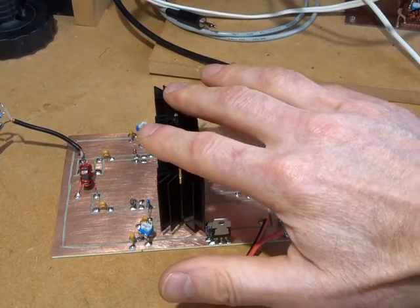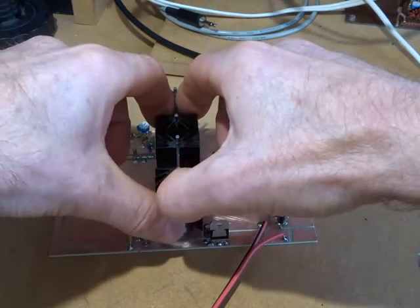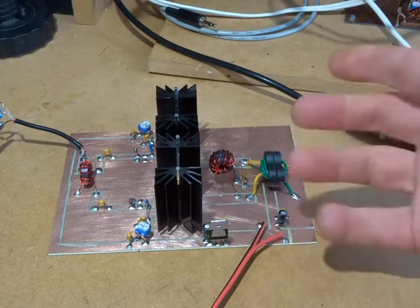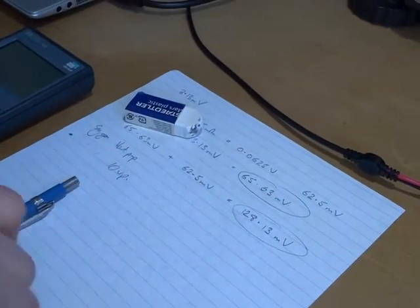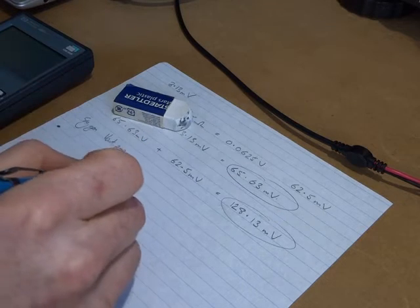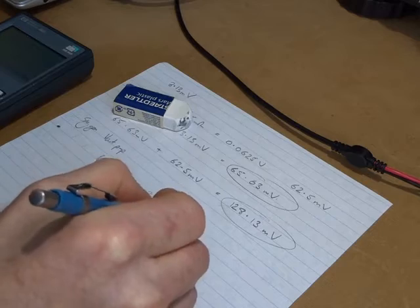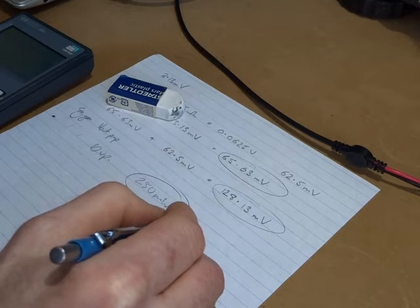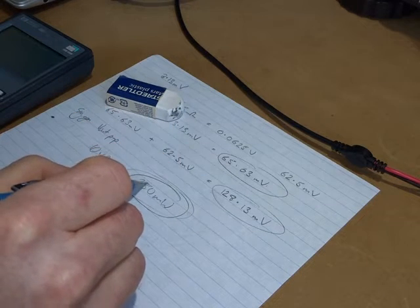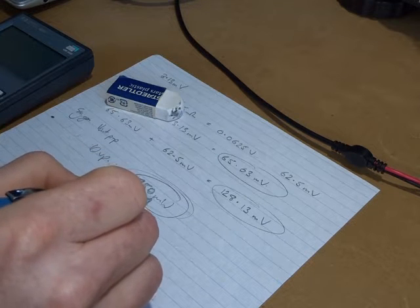I wasn't quite sure if those heat sinks would be sufficient. Squeezing those hard — nothing's burning, dead cold, no warmth there at all. So that seems to be working reasonably well. In terms of the drive: we said that was 10 volts peak to peak. Dividing by 2 gives us peak, times 0.7071 gives RMS, and V squared over R gives us 250 milliwatts. So 250 milliwatts on the input side of that 1 dB pad. That's the drive power we'll need — certainly for the 80 meter band — to get 12 watts out from the driver amp, which we'll look at in due course.